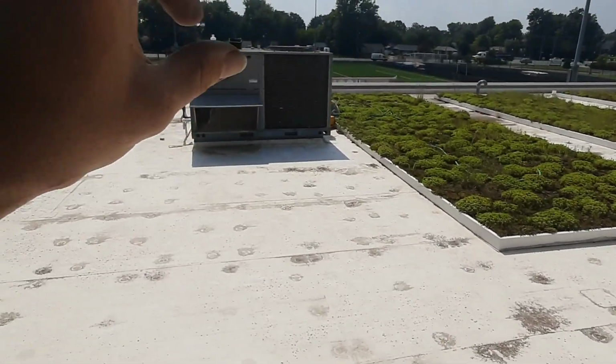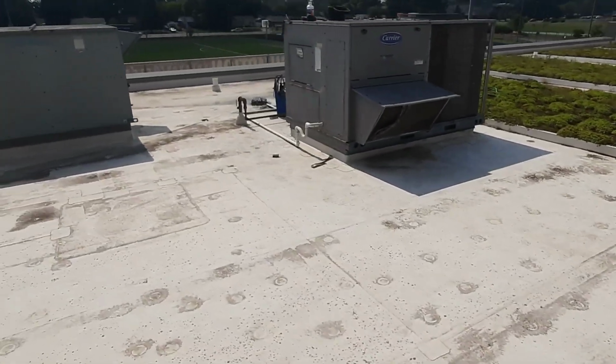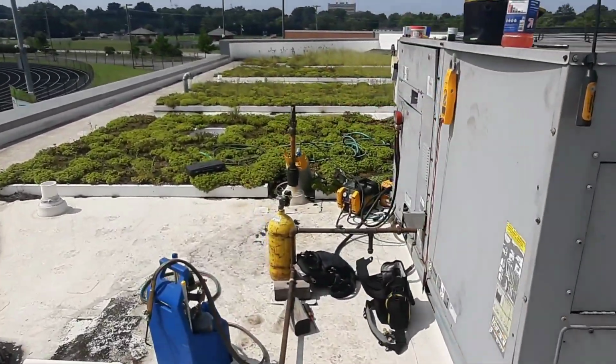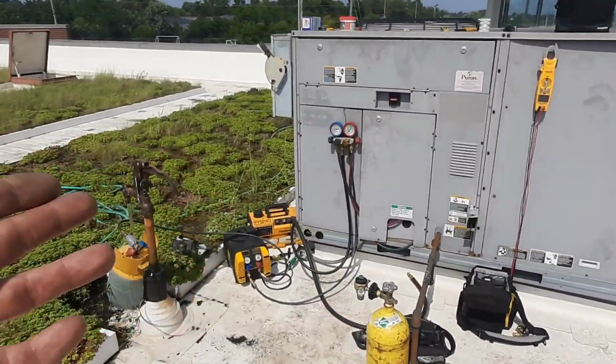It looked low, but I think what might have been a slight restriction in the beginning has gotten worse, obviously, and plugged my dryers, whatever it was. It's got to be the oil. I put the same refrigerant back in, and that stage looks fine.